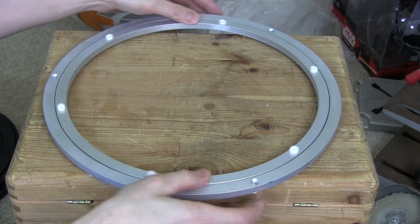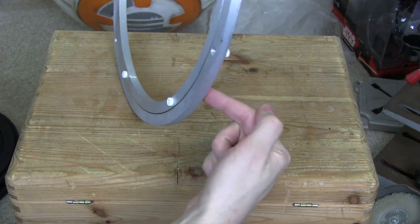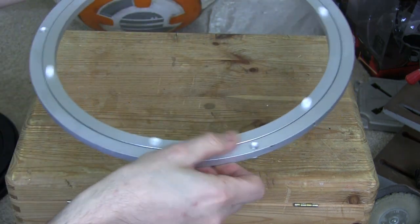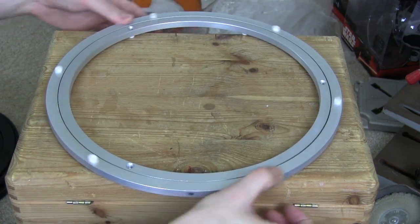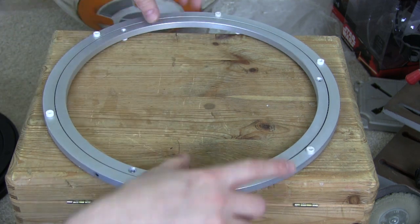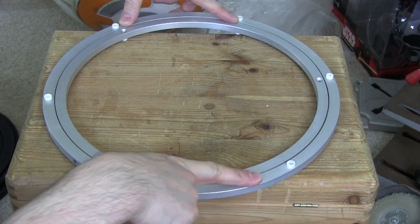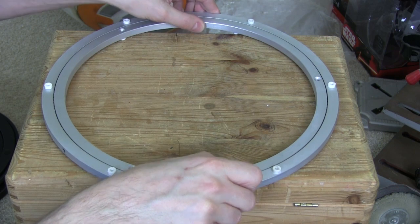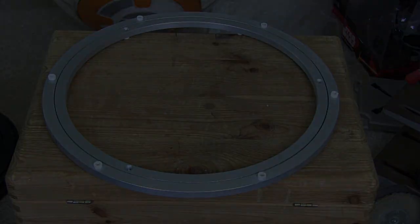So again, it's designed to work one way up, to press this against this, but because it's a ring inside each other, that's going to be easy to mount. So I just need to make sure that I mount it the right way up so that the two halves are pulled together in the way it's expecting, and then I can mount that on 4 points, maybe the inside ring, and just screw the outside straight to the flywheel. And that'll hold everything rigid, or maybe 4 mounting points, and it'll stop it shifting so that I can get good traction with the motors.